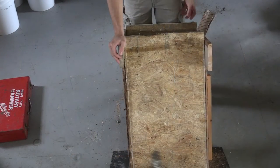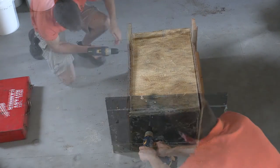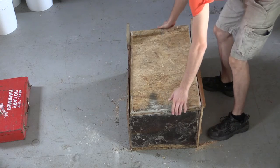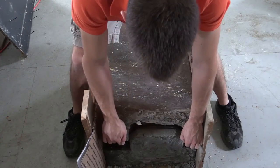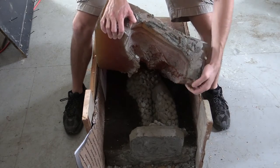The cement should be removed from the mold after 14 hours to allow it to finish curing. Gently remove the duplicate from the mold to prevent cracking and damage. Admire your creation, then create more, or remount the mold and make a new one.